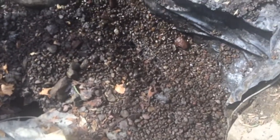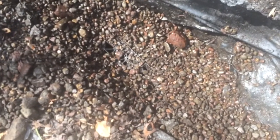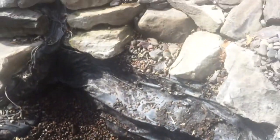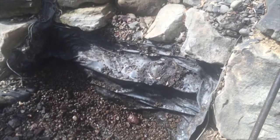They used very small gravel originally, and that has a tendency to clog up these water matrix blocks. Also, the way the water matrix blocks were installed, they were not structural, so they're actually collapsing. That's where we're at right now — we've got a couple more days to go and we'll get it all up and running.